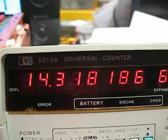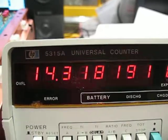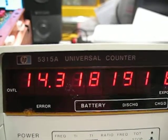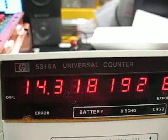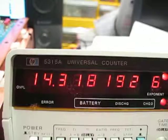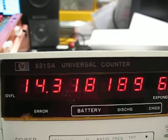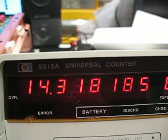I'm going to stop the disc now. Watch what happens to the frequency — I'm doing a real high-accuracy measurement, so it takes longer to respond as it does more acquisitions to confirm accuracy. You can see the frequency raises up as soon as you stop the disc. It would be inherently wrong to set it at 14.31818 with the disc stopped. As soon as I start the disc again — remember it takes a moment for the counter to update — you can see it then drops significantly.